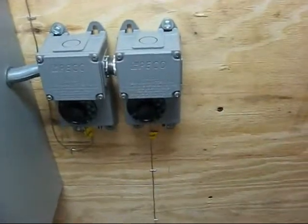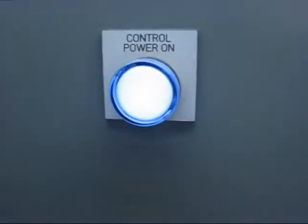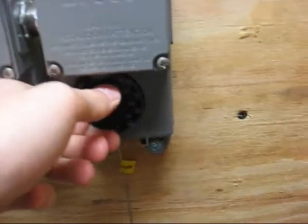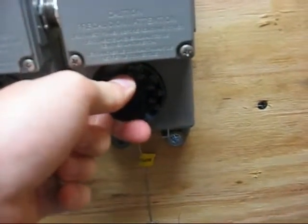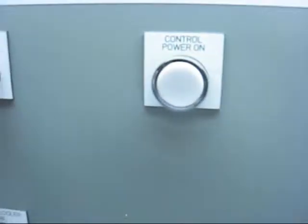However, for testing purposes, it's about 85 degrees out right now. So what we'll do is it's set at 104 right now and you can see the system control power is on. If I drop this below our current temperature outside, it should turn the power off, which we'll drop this down to about 80. And you hear the thermostat click and our power is now off.